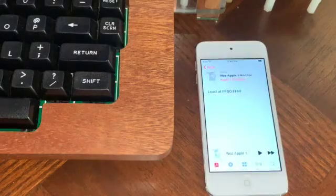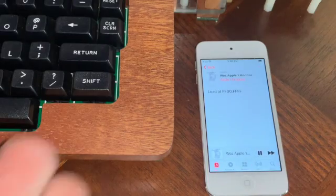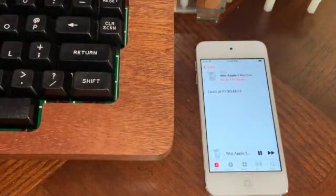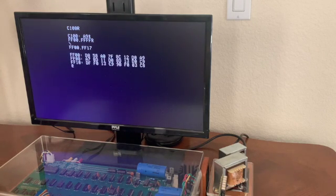The F block is already in the mode to read from ROM and write to FRAM, so now we can load the Apple One monitor into the FRAM. We are still reading from ROM. If we read FF00 to FF17, we see the monitor in its proper location.